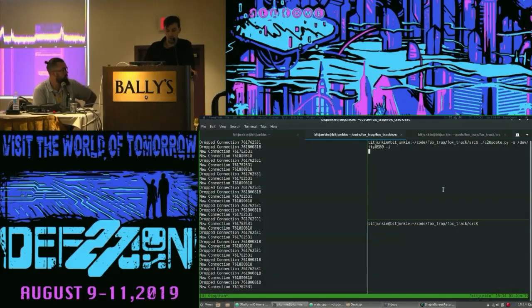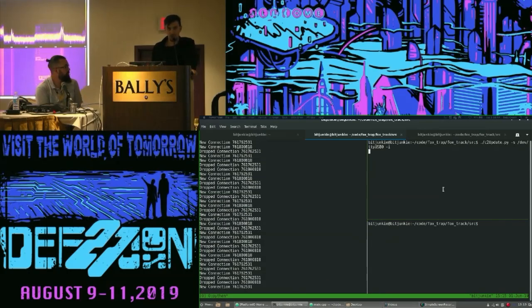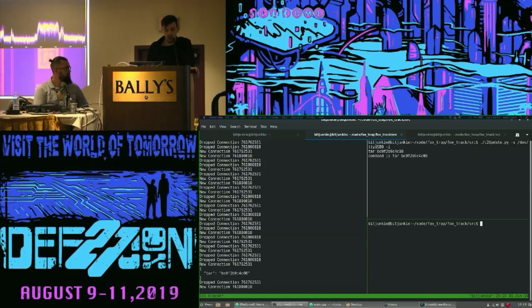On the left here is a bunch of traffic on the root node over serial — you can see the different wireless connections we're making with our slaves. On the right in the upper corner is an updater script where we're updating the root over serial before the root sends commands to the rest of the bots in the mesh. In the demo, I sent a target — that's a MAC address, a real MAC address of one of my devices — and the root is acknowledging with a JSON blob that it's received it and sent it over the mesh. So now these nodes are actually hunting.